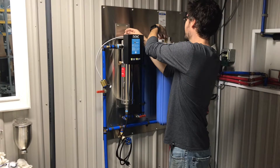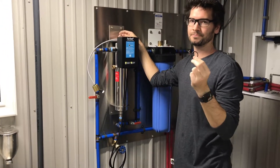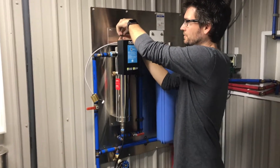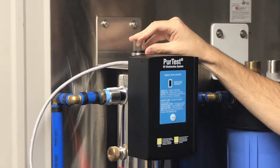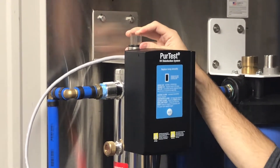Inside the owner's manual bag there's your black o-ring, and this is going to be your watertight seal. This o-ring gets installed on the outside of the quartz sleeve — just slip it over and push it straight down so that it's seating against the stainless nipple, but not going over the threads of the stainless nipple.